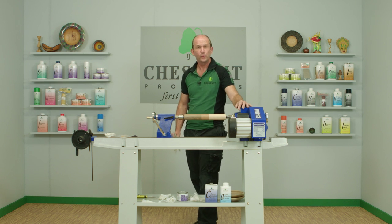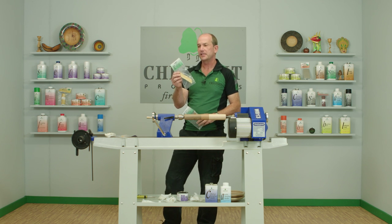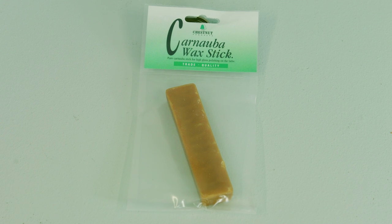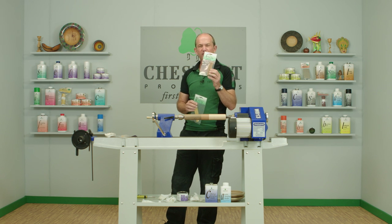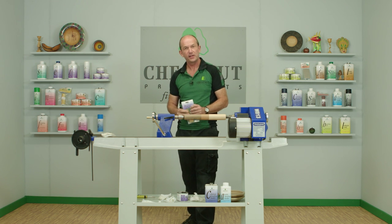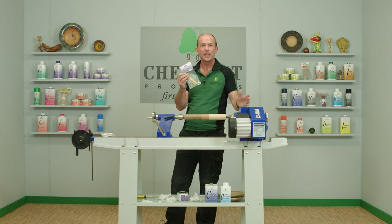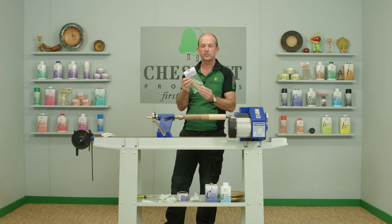As well as the paste waxes we also have a couple of stick waxes in our range. We have the Woodturner Stick Wax, which is a blend of beeswax and carnauba wax, and we also have the Carnauba Wax stick — that's just pure carnauba, so it's very hard wearing and gives a really bright finish, just a little bit more difficult to apply because it's such a hard wax. A few years ago at a demonstration someone suggested making a micro crystalline wax stick, and we couldn't think of a good enough reason not to — so we did, and this is it. The principle for application is the same on all three.